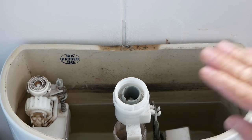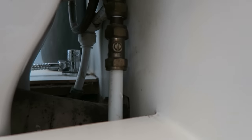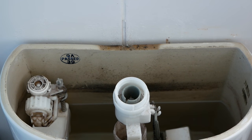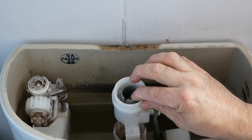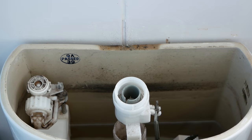So the first thing you want to do is cut the water off. Take your screwdriver and cut off the water. Basically, that's the water there — I'm going to switch it off, turning it 90 degrees, and that should be the water off. I'll give that a flush just to make sure. And there's no water going back in, which is good.